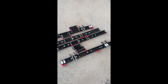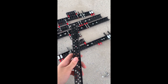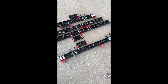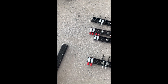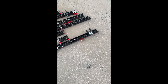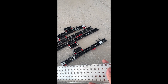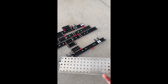We'll start off by preparing all of your forward drive channels — one, two, three, four — and you also want your cross braces. It's not as simple as just screwing your cross braces with shoulder screws, because oftentimes we'll be mounting our bracings offset and off of spacers, and shoulder screws don't really work across spacers. So what we'll do is mount temporary cross bracings across the robot, make sure everything is aligned, then mount the main bracing and remove the temporary ones.